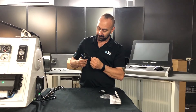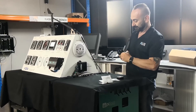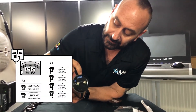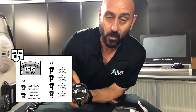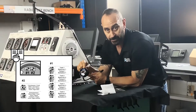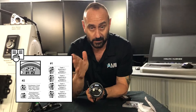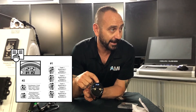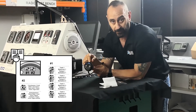This unit isn't just set for one tank. You'll see here there are some dip switch settings. Those dip switch settings are two different lots. One lot is to say whether it's waste or water, so you can use this for waste or water — the system will get on its N2K message that it's waste or water. And on the other one, it will give a tank number, and you can have tank 1, 2, 3, or 4, depending on the combination.